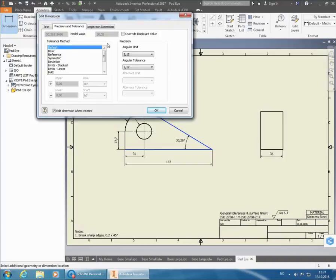And first of all, this is just going to be a way for whoever is machining it to just quickly check that it is approximately on the right track with regards to the angle. So we're going to put it in as a reference with the parenthesis around it. And we're also going to change the units so that we don't get any decimal points in it. So we're going to remove all decimal points, then it just shows up as 30, because since it's not a requirement to have this measurement at exactly 30.26 degrees, there's no point in actually showing that much detail to it. So 30 degrees is more than enough to just check that you're more or less there when you're creating it. It is the length of 137 and the radius up top that decides exactly what the angle is going to be.